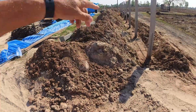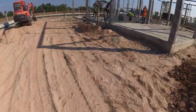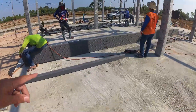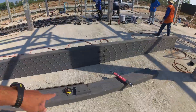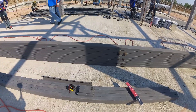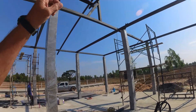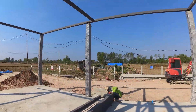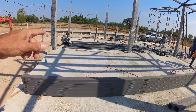The guys are working on this beam — probably another hour on it. They're double-stacking C-channels, tacking them together, and then butt-welding them. It's a pair, a pair, a pair, and then a pair on top — they'll end up with four double C-channel beams. I'm guessing those will run from the end of the ridge beam out to the corners. That's my guess on the four-sided roof. I think I've figured out these are going to be what I'll call rafters.